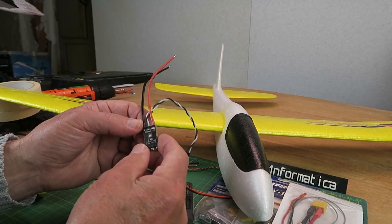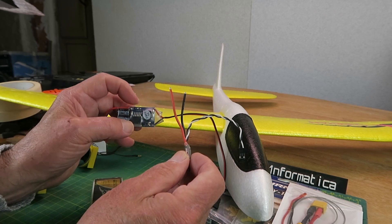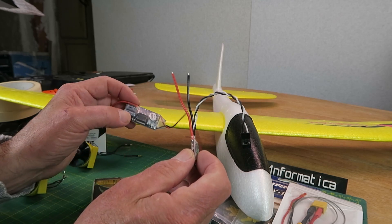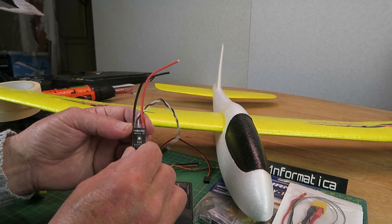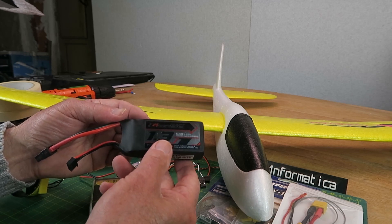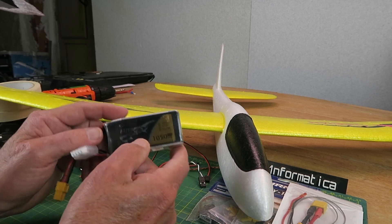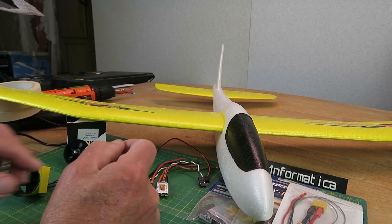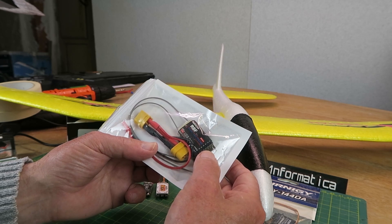I'll be using something like the small quadcopter ESC. One downside of the little guys is they have no BEC function, so I've sourced this little BEC — which may be overkill at 5 amps — just to drive the servos, receiver, and maybe a gyro if I decide to include one. It even has a little LED, so I could set up green and red for port and starboard. Battery-wise, I was using a graphene pack 3S 1300mAh in the Lidl EDF, but that may be a little heavy; an alternative is a Tattu 1050mAh. I'll have to see when working out the center of gravity. My receiver of choice is the RadioLink R8F, which I like especially for its telemetry function to monitor flight pack voltage.